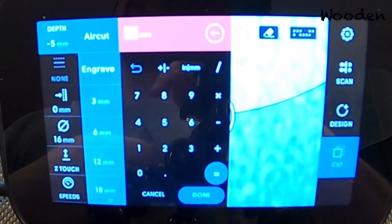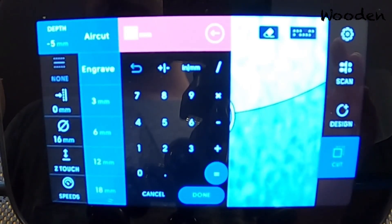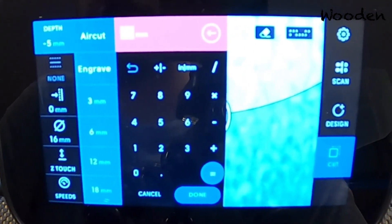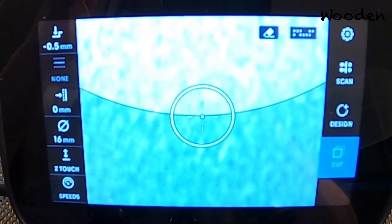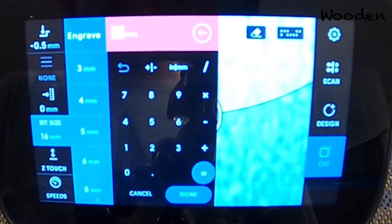You can cut an eighth of an inch, then set it to a quarter inch and cut again — taking multiple passes. The deeper you go, the more pressure on your router and material, and things can go wrong. I recommend multiple passes; I typically go around 2 to 3 millimeters per pass. There's also a button for an offset, if you want to cut one millimeter next to the line rather than on it. Then you need to select the router bit size — on the European machine my bit is 8 millimeters, so I select 8.